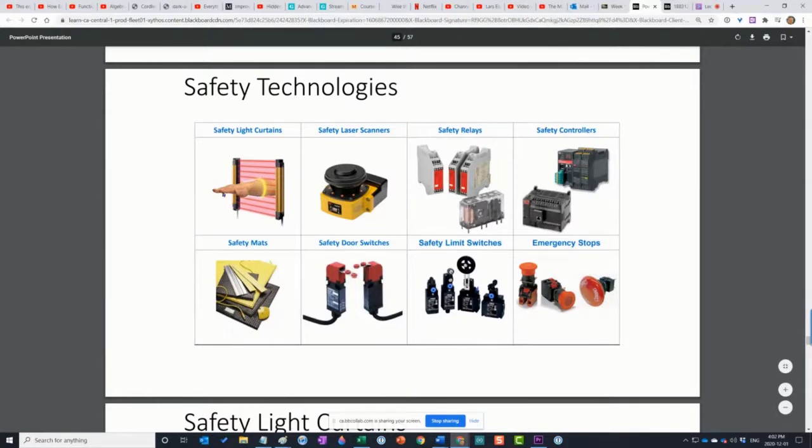The funny thing is that it actually happened more than once. There were a couple of times in the robotics lab where the robot ended up going outside the safety curtain, and it stalled the robot, but the robot would not turn back on because it was in the safety curtain, so we couldn't get the robot to reverse out. It was like a catch-22. We had to disconnect the safety curtains and physically remove them, then turn the system on and then off again. And we had to build a special thing to have these set so that they could see each other. It was ridiculous. It took us half a day.